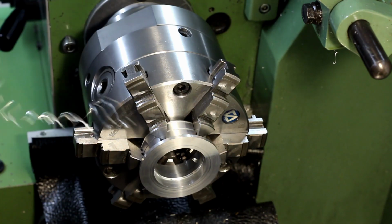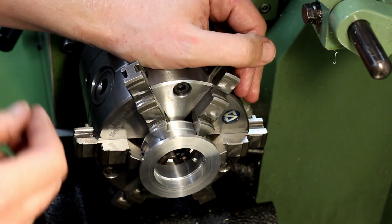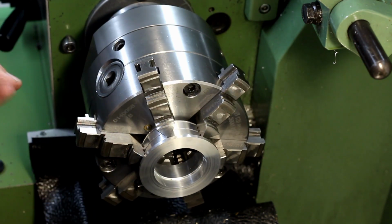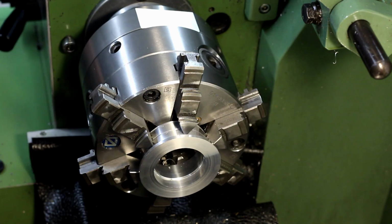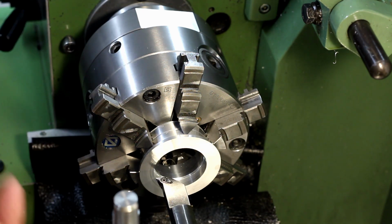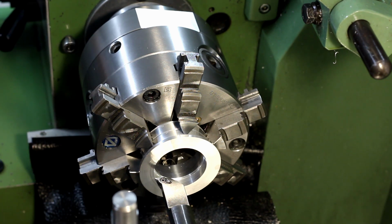And yes, breaking the chip would require basically a little bit more feed, higher speed, but as I run a manual machine, it's not always happening that you can break the chip actually. Sometimes you just have to deal with a stringy mess of chips. That's reality. Or you can try and play around for hours breaking the chip or just get the part done in time.